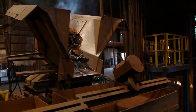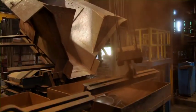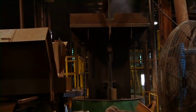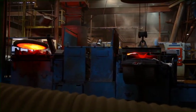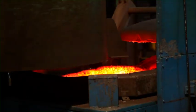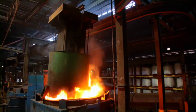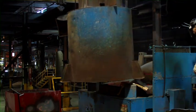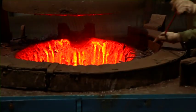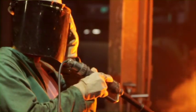These raw materials are weighed according to a specific recipe to obtain a 2,000-pound charge. The materials are weighed into a 600-degree preheater, which removes any oil or water that may be on the material. This is an electric induction furnace. The furnace runs at 2,800 degrees Fahrenheit and can hold up to four tons of molten metal. It takes 15 minutes to melt all the 2,000-pound charge into a super hot liquid metal.